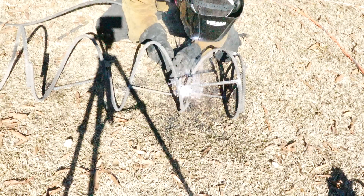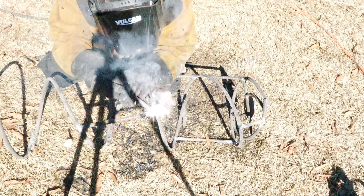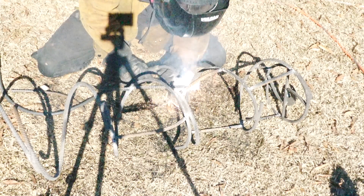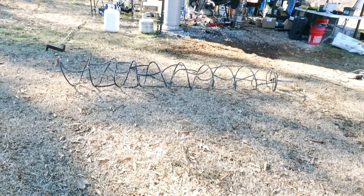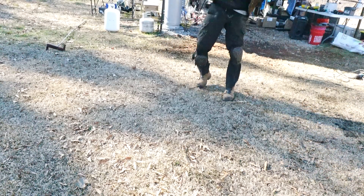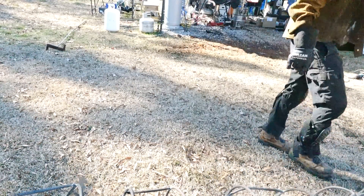One day we're going to get these blades professionally done. The good thing is they're a modular feature of the machine so they can always be upgraded. I'm also thinking about whether it'd even be worth making the blades of this machine professional or if it's better to just wait for the next machine. I've been in talks with a few people about 3D printing the blades. A shaftless auger blade is always going to be weaker than a shafted auger, but there's a reason we make it shaftless. Take a look when I had all the supports in — this thing is sturdy. It looks like a Gatling gun.